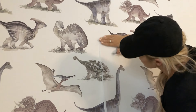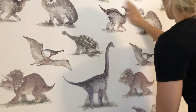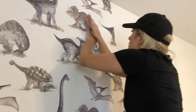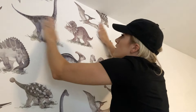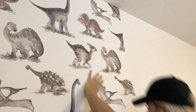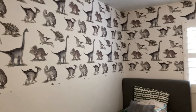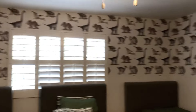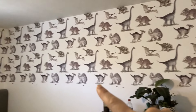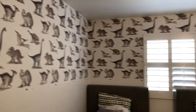She matched up the corner, and then you always rub the bubbles toward the outside — the seam edges. If you try to rub them up or down you've got a long way to go. The wallpaper is done all the way around. Now we're going to do this trim piece right here — we have a nice little setup for that.